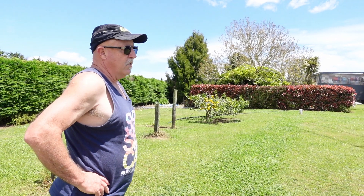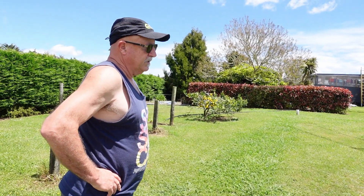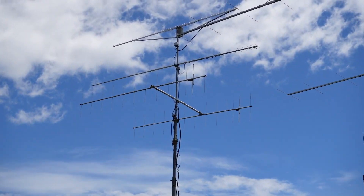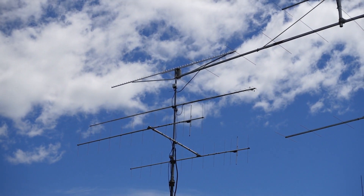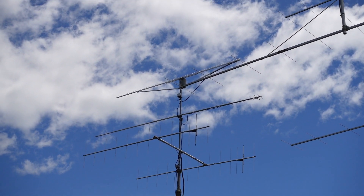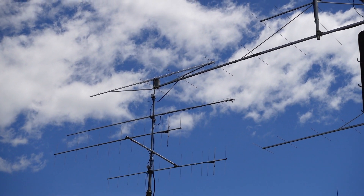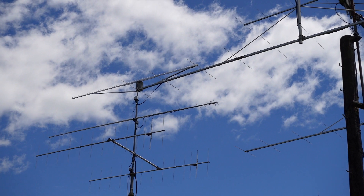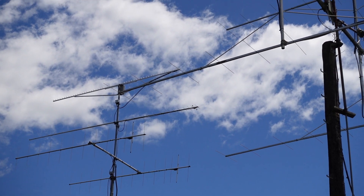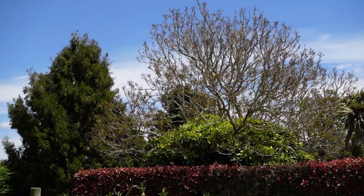The elevation doesn't work anymore but I'm more interested in terrestrial — Sporadic-E and Tropo. So here to Australia there's no trouble at all when it's open. And it's very sharp too. On this other tower — I've got a pair of Cushcraft 13B2s vertical. I use those for listening to the paging systems in VK which are just above 148 MHz. I listen and the moment I hear them, they're just an indicator. Long before chat rooms started, I used those paging systems and also the FM band for indications of Tropo or Sporadic-E.